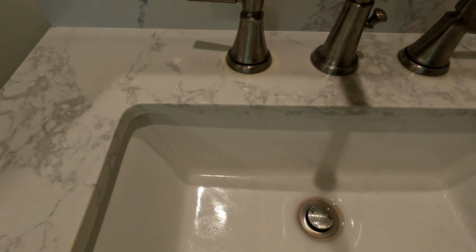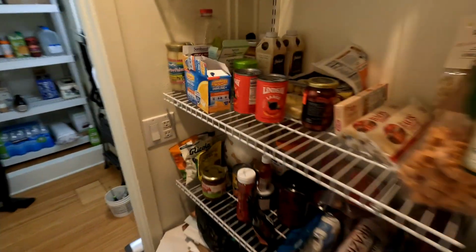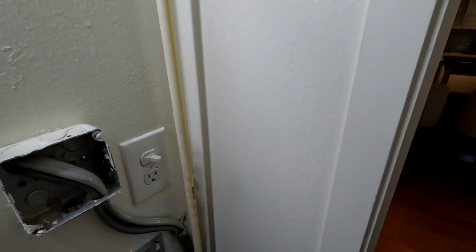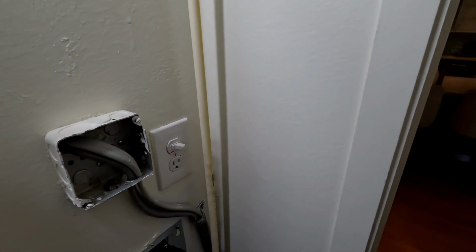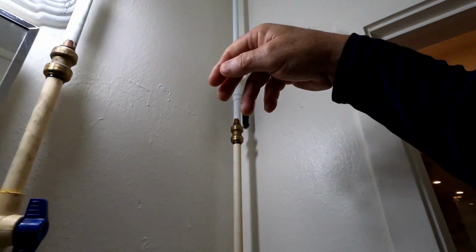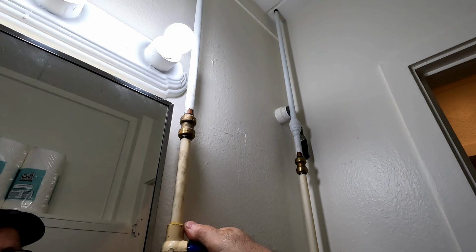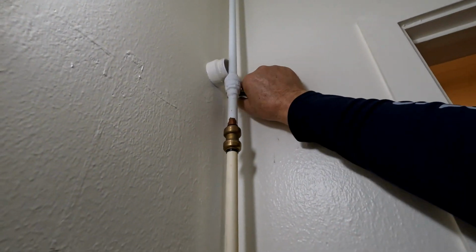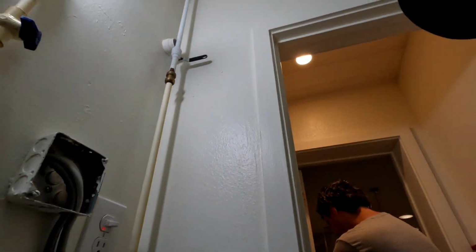What I really should do is just open that pipe up while I have it and see what kind of pressure is going into it. Okay. It'll be easy enough to do that. Shark bite up here. Yeah, I think I can just pop this shark bite up here. Shut that valve. I'll shut this one to keep water from coming back up the other side. And I can pop that and see what kind of pressure we got coming out of this thing.